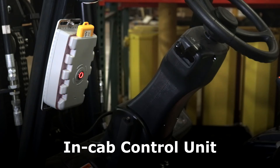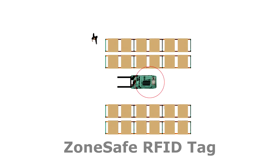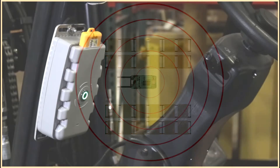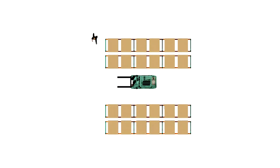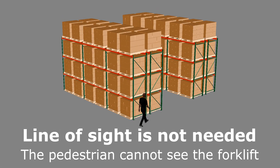The NCAB control unit also has the capability to store and send activity data. An RFID tag is worn by anyone who works in and around a protected area. A tag is identified by the system when it crosses into a detection zone. When detected, an audible visual alert is activated, warning vehicle operators of the tag's close proximity to the vehicle. ZoneSafe RFID tags do not require line of sight and will be detected regardless of obstructions, blind spots, or poor visibility.